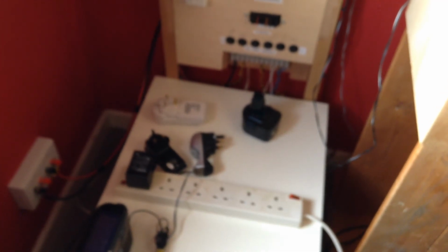Now, that's fine if you want to draw 5 amps for 20 hours, which most of us don't. Bearing in mind, I said, a lot of us use power inverters, which draw large currents. So, with a 100 amp hour rating battery, if we said that you can draw 5 amps for 20 hours, then some of you might surmise that if I drew 20 amps for 5 hours, I would still have 100 amp hour capacity of the battery. But unfortunately, this is not true.